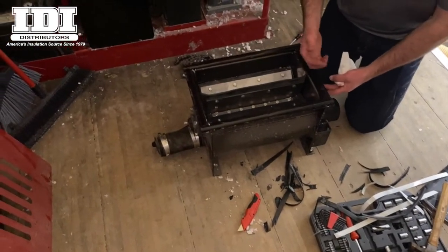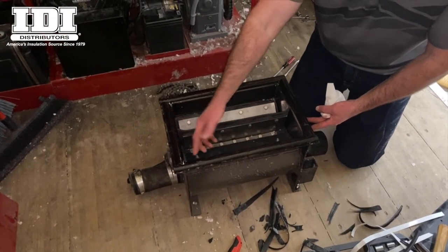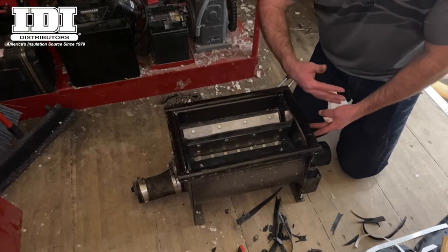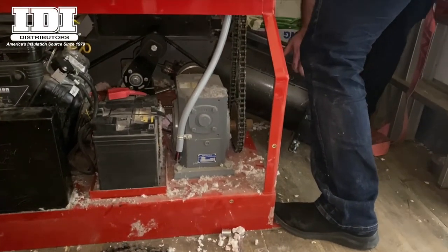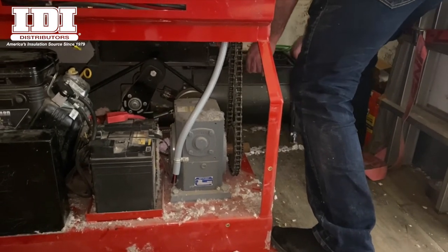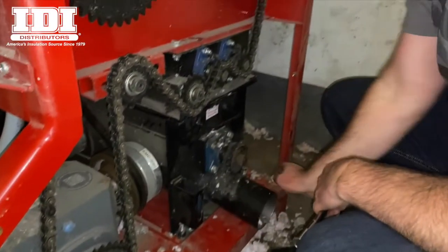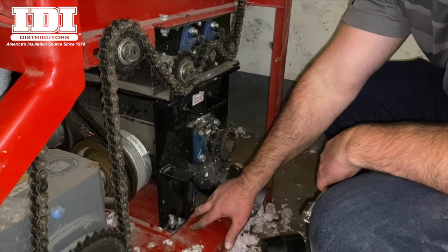When we took this airlock out it was really tight, so when we slide it back in it's going to fit very snugly. We put a little bit of vaseline or any type of lubricant on top of the seal so that when it slides in, the seal we put on does not tear off when it gets stuffed into the airlock. For reinstallation, we tighten the lift bolts first — that lifts the airlock up — and then we tighten down the hold-down bolts.